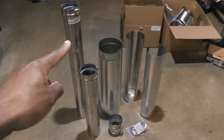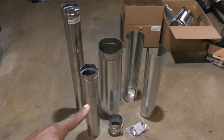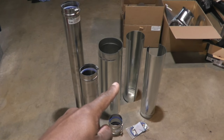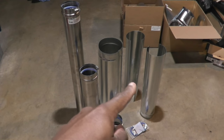Starting with the 36-inch section of that special gas pipe, there's also a 24-inch section, an adapter that goes on the back of the heater, some extra gasket material, and then they provide some single wall pipe — a 7-inch 2-foot-long section, and two 4-inch 2-foot-long sections.